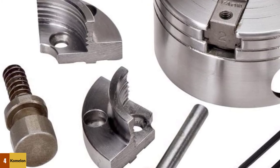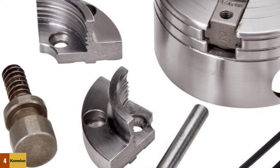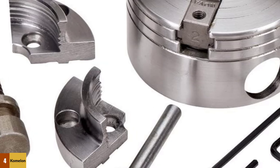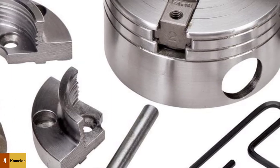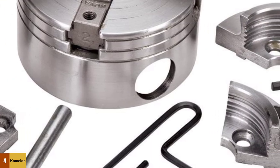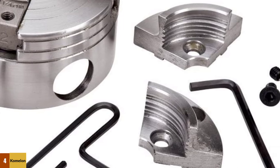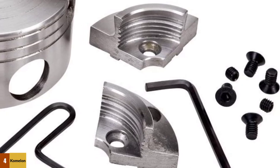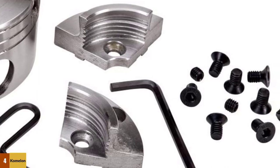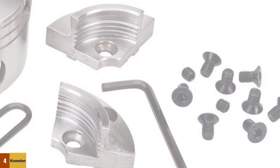The 1-inch x 8 TPI direct thread chuck is compatible with any smaller lathes; however, you can buy an additional chuck insert if required. The self-centered jaws are quick and easy to move — turning the screws, it can expand wider to accommodate a large chunk in a secure grip. The auto-stop option is always a handy feature to help prevent the jaw slides from being ejected from the chuck. The only downside is the tiny Allen wrench, which may be a bit awkward as it can't clear the top of the jaw perfectly. However, the chuck design allows excellent holding power, providing powerful strength to hold things and make perfect shapes.